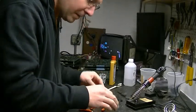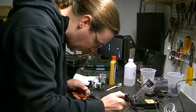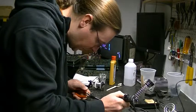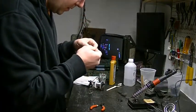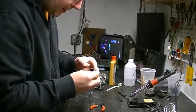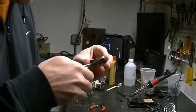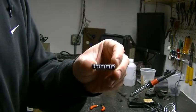It's a little offset, so I'll hit that one more time. It's not the neatest in the world, but once you've got it in there, you'll notice the leg on the end is a little longer than the others. So just trim off the end so it's about the same length as the rest, and that's your fixed chip.